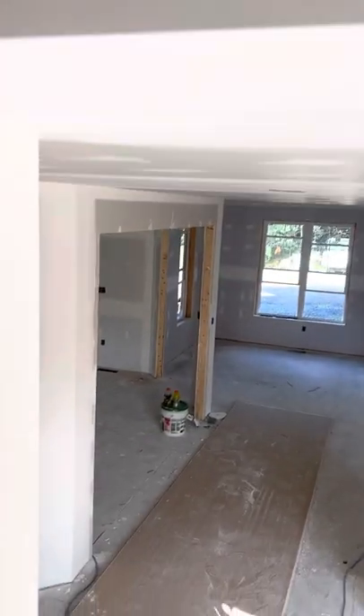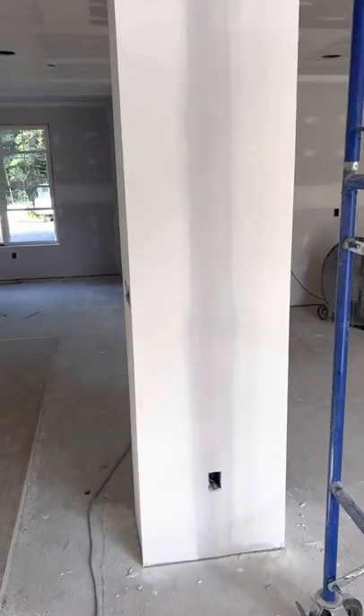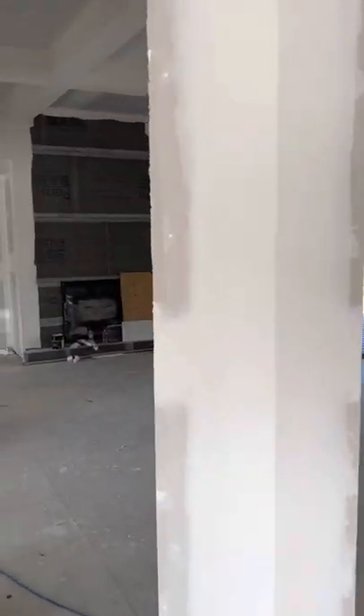This has been sanded here, just with the machine. I haven't done anything by hand. I'll go through and machine everything. I did the side walls. I did not do the ceiling yet. But if you look down this wall, I'm not sanding hard. Even though you see a little bit of bevel here, it's still perfectly flat. I sand all the way up into the angle. Then I'll come back with a light and hand sand all the angles and make sure there's no goobers on the wall. A lot of this here is dust — it's just on the drywall from itself. I'll sand all my side walls first, then hop on my short stilts and sand out the ceiling, and then start sanding the ceiling angles coming down.